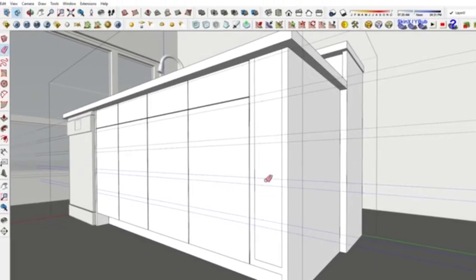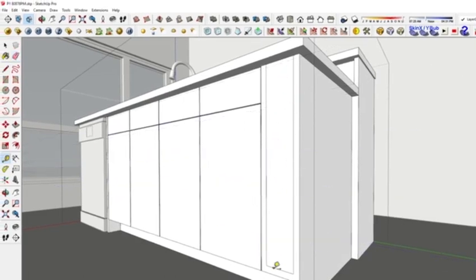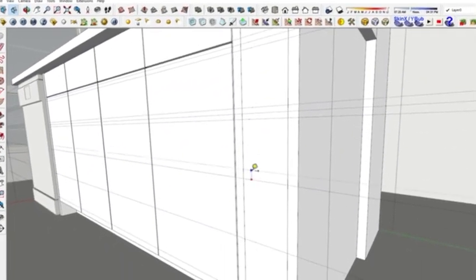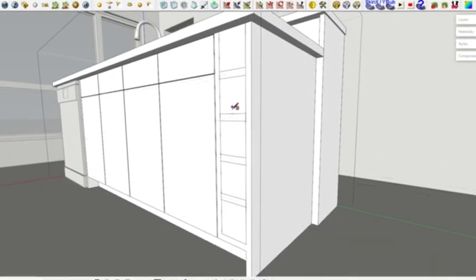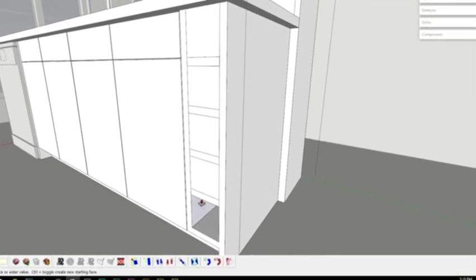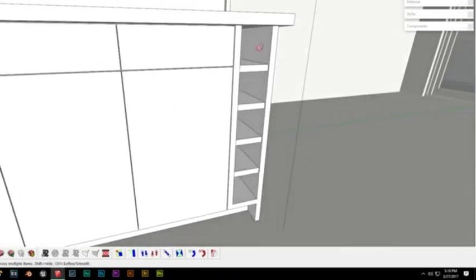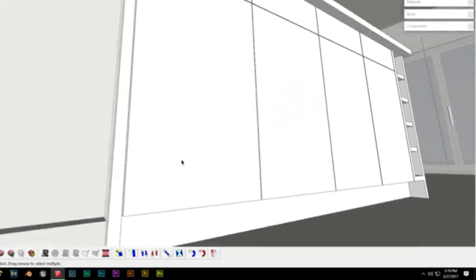So the easiest way to do that then is to just create basically 5 equal parts. So we'll drag this out 1 inch. Create parts like this and scale them up to the top, and then just create our 1/2-inch spacers either side of this. There we go. Now we can erase our guides, and we'll push these back in. We'll say 16 inches, and then inset these a little bit as well, maybe 1/4 of an inch. There we go, and that'll give us an extra little wine rack on the end there. I think that looks pretty good. And so that does it for the cabinets.